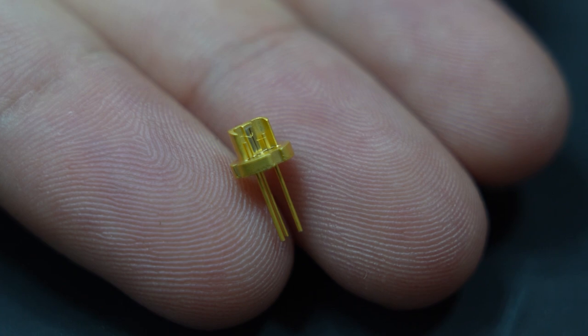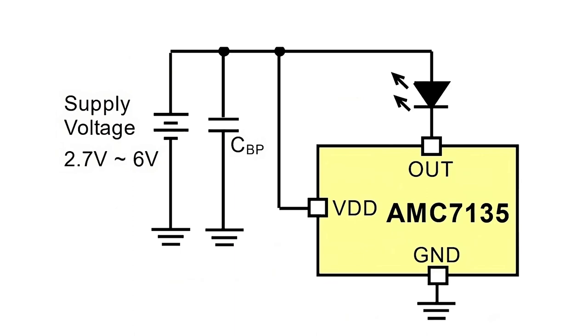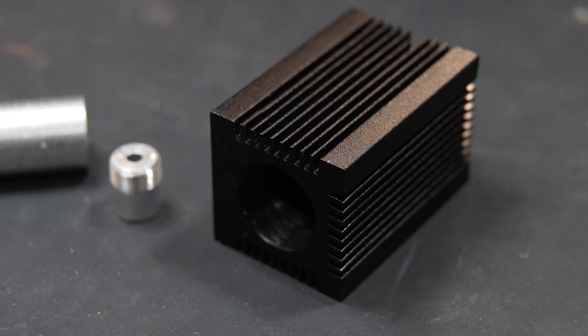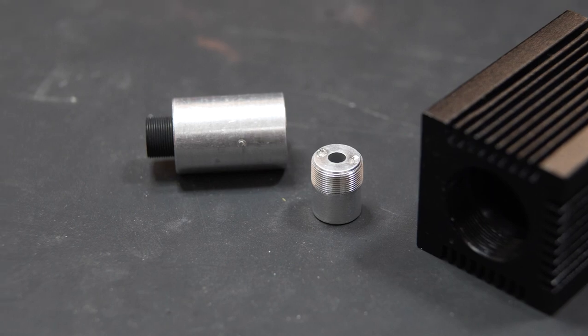For the laser part of this, I am using a red laser diode from a DVD burner. These are nice because they are bright and have excellent beam symmetry. To drive it, I'm building a simple driver circuit using the AMC7135 current regulator. The laser and the driver will be mounted in this nice laser heatsink that includes the necessary optics as well